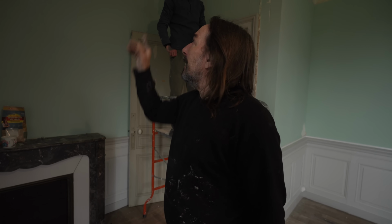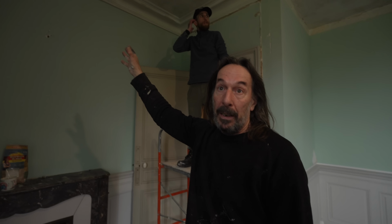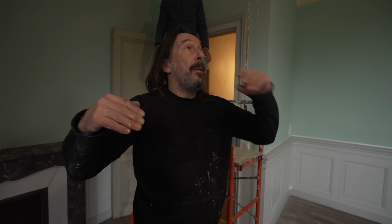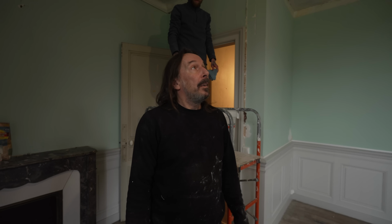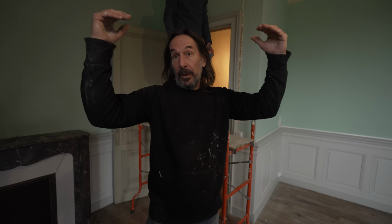Well, we want to get these cracks filled in anyway. Even if we stay another half hour, it's fine, because that way they're all going to be dry by tomorrow, hopefully. And you're going to paint it tomorrow. That's going to look fantastic, just with paint on it. Then you can go around and analyse it, like you said, and repair anything that needs repairing. Bearing in mind that when we put a coat of paint on, it will seal it as well. So it's going to do more good than harm, not only so that we can see visually, but it will seal it again as well.